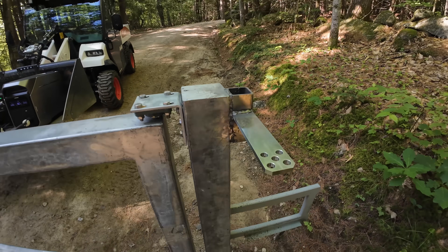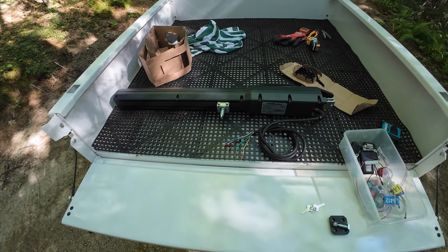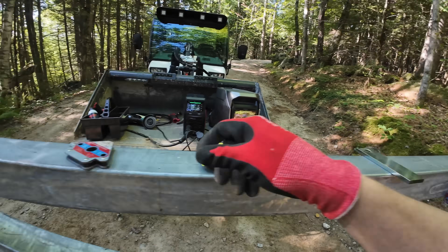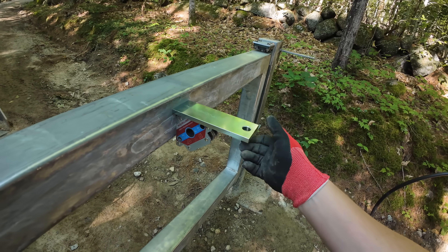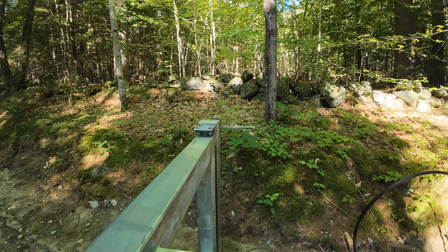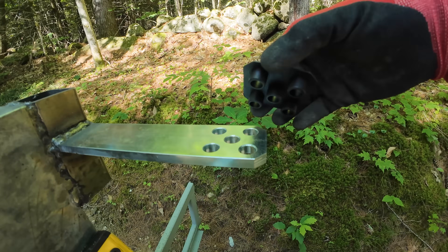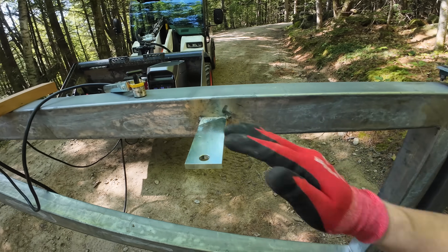This is a LiftMaster opener, an LA500, sold as a solar kit. Solar panels were never going to work for me because there just isn't enough sunlight here to operate the opener throughout the entire year, especially winter. Additionally I wanted cameras and different access controls, and the solar built into that kit was never going to be enough. The opener just needs two mounting points at exact dimensions per the directions. A little bushing protects the bracket from wear, and they give you five holes so you can reposition the opener if needed. If you turn the key on top, it goes into a neutral mode allowing you to manually move the gate — perfect during install.